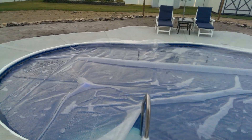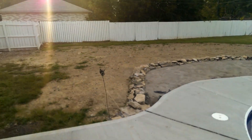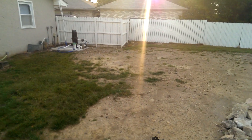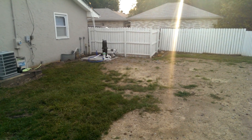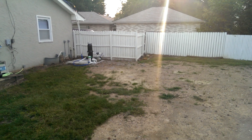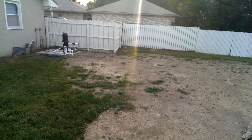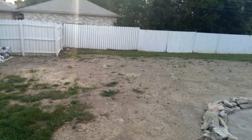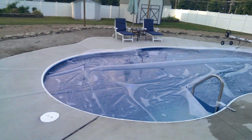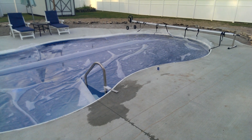The tips we use: always keep your solar cover on. When it's a really hot day, we turn our pump on around 10 or 11 a.m. and keep it cranked till 5 or 6 at night when the sun goes down, because we're playing with that fine line of dropping below 90. If you don't do that you can't keep it on all day, but you'd probably stay around 87 or 88 degrees, which isn't bad. But we like it really hot, so we just keep it pretty high. If you have any questions, let me know — thanks.